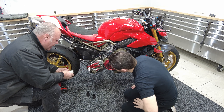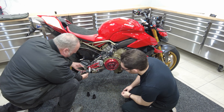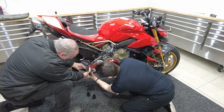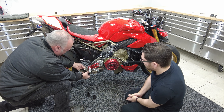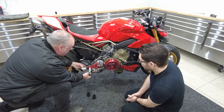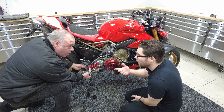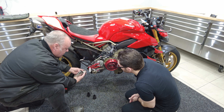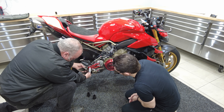They just need to determine the length to work with — going from 60mm diameter down to approximately 44mm. Roberto grabs a vernier caliper to confirm the measurement. Jeff suggests using stainless dome heads to match, and Roberto confirms he has the same. Jeff says he can make the internal a captive thread and just bolt the tips in with a button head, which should look really good.